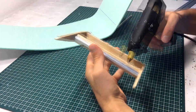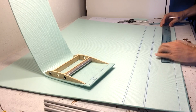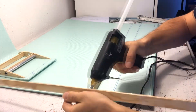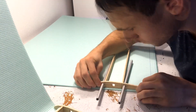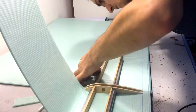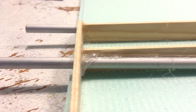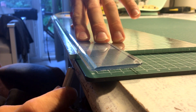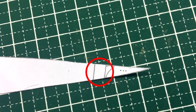I have pre-folded the foam that will form the skin and attached the skeleton to it. Now it was time to start working on the actual wings themselves. These beams will be the main structural elements — in wing terminology they are called the spars. They were carefully positioned to exactly align with the aluminium pipes. I used a lot of hot glue to make sure this joint is not going anywhere. The pipes were also purposefully angled downwards to give the wing some dihedral. This part will be a small spar at the trailing edge of the wing, which will cap off the wing box just before the flaps start.